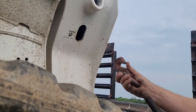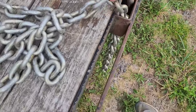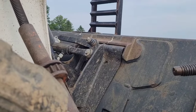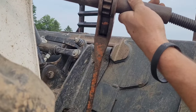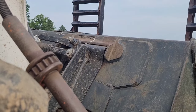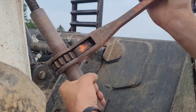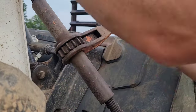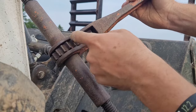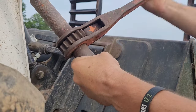We're on the front of the bobcat now — very similar process. It's designed so the binder can go in there and the chain can be hooked on the trailer. Note that the threads are only so long, so if you get too close to the end it will come out, but it just simply threads back in. When you have it maxed out, you know you have as much slack as you need to get it tightened down — simply flip the buckle and start tightening. These binders work a lot better when they're lubed up. Use some WD-40 or spray on the buckle and on the threads — you could use grease on the threads too. If they're sitting out in the weather a lot, they'll seize up, so keeping them lubed makes it much easier.